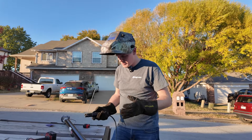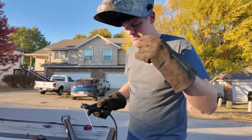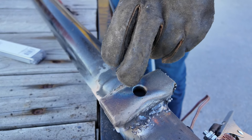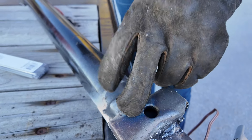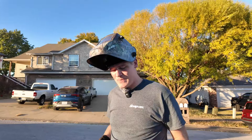This machine is doing really well. What we've learned here is I'm not really good at this process of welding and I need to practice more. But looking at this weld down here, you can see there's a color change through this heavy piece of material. We're getting really good heat output and some good penetration into the base material that we're welding to. This welder is doing really good — some of this is just my skill level holding us back.